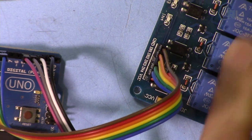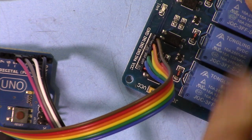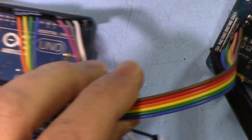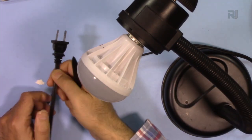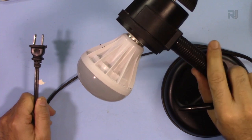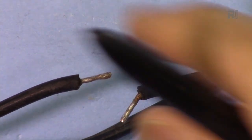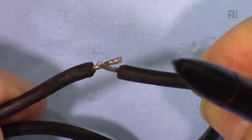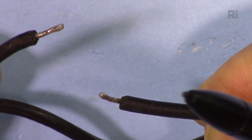The Arduino's 5V can handle the current for this relay. If your relay is 12V, connect VCC to your 12V source instead. For the AC load, I have a desktop AC bulb connected to a 120V power plug. I've cut one of the two wires at a point, twisted and soldered the ends, and connected them to the relay. The relay's job is to connect or disconnect the circuit to turn the AC bulb on or off.